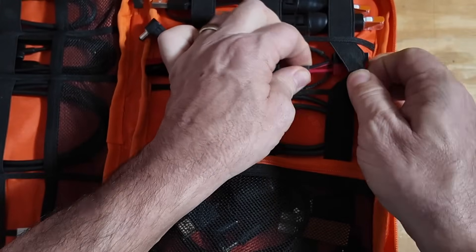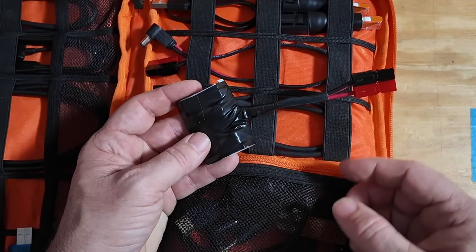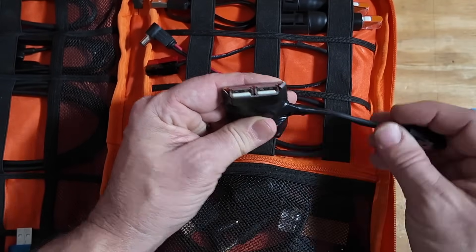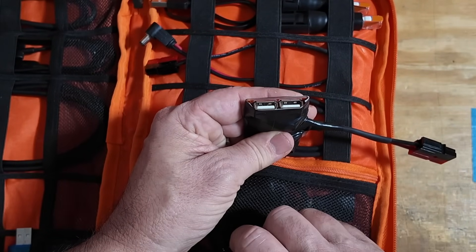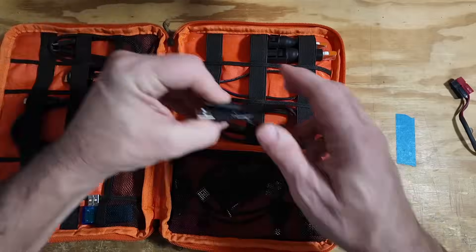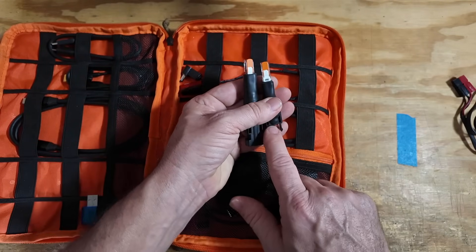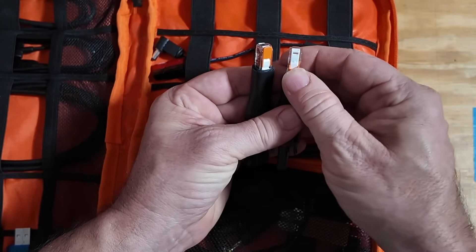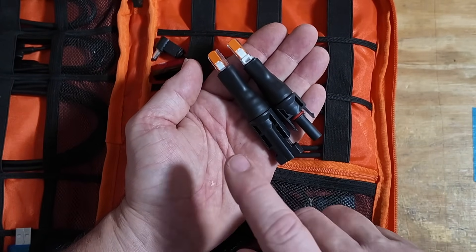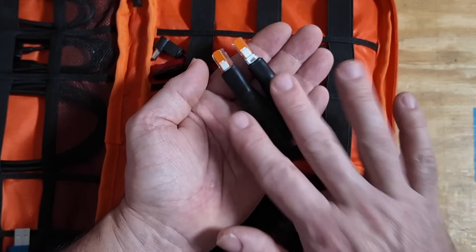Let's take a look at this little device. I used it more when I was really running Raspberry Pis a lot; I don't use it quite as much anymore, but I'm going to leave it in because it can occasionally come in handy. It's got power poles on this side and gives two USB ports on the other — so if you need 5 volts, this will take your 12 volts and convert it down. And here's that second power pole to barrel connector. We've also got these guys — a new addition. They've got lever nuts on one end where you can stick bare wire in, clamp down, and lock it in place. The other side is MC4 connectors. So if I needed to make a field repair to a solar panel, this would allow me to get the job done without having the MC4 crimpers with me. That's why these live in this bag.